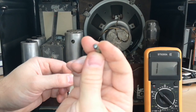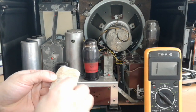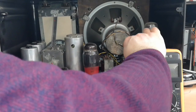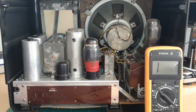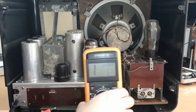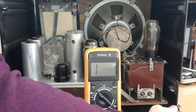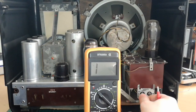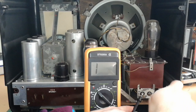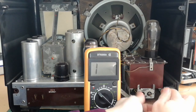Take a look at this side. Now let's clean it. Much better now. I will put it back. I will eventually replace this fuse with a completely new one. Now this is better. We can measure again here — nothing. Now when it's turned on it shows around 70, 80 ohms. And this is okay.